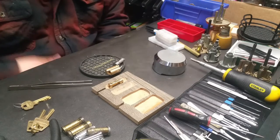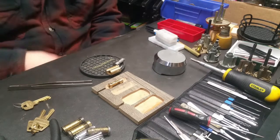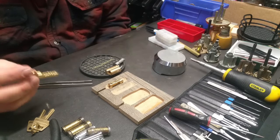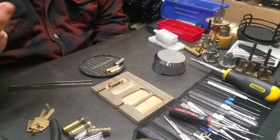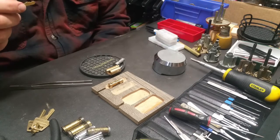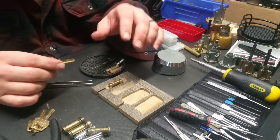So what I did was I went through the bunch of keys, because one of the things I get out of it is pack lock keys. I get factory cut pack lock keys, and usually there are full sets in there, so I usually wind up with at least two. I've got quite a few up there on the same hook with my American keys, because they're all the same keyway. Pack locks are 6-pin and most of my Americans are 5. I have a couple of the original Americans that are 6. So I wanted 6 pins when I repinned this, so that it was more secure.